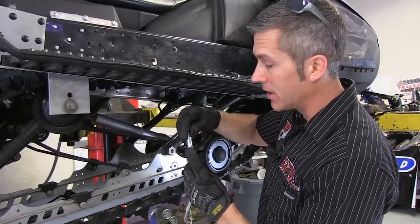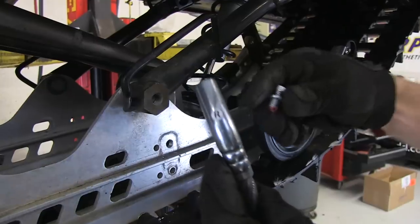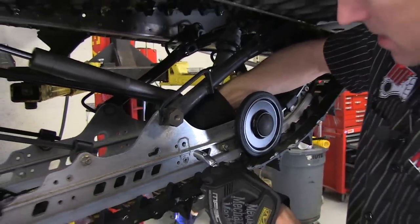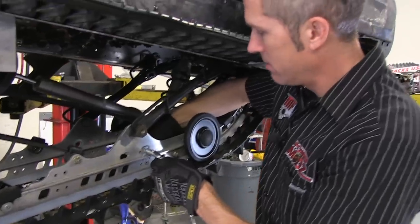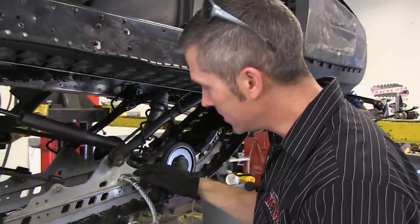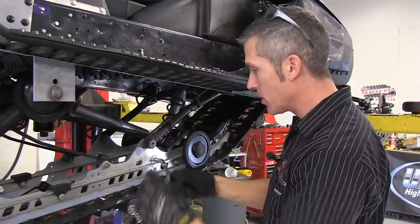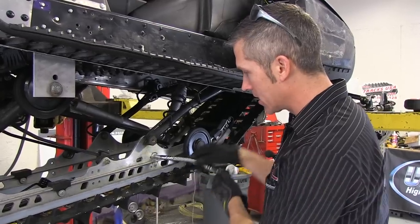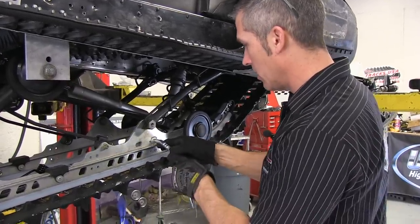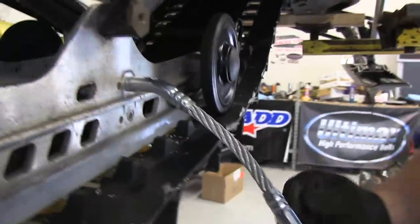Each of these scratchers has a little sticker on it indicating what side it goes on — this one is for the right side. Make sure you put the lock washer on the inside. Slide that through. Now you want to set this up so it's pointing 90 degrees down. You don't want it up on an angle — it's not going to come in contact. You don't want it too far forward either. You want it pointing straight up and down, perpendicular to the ground.